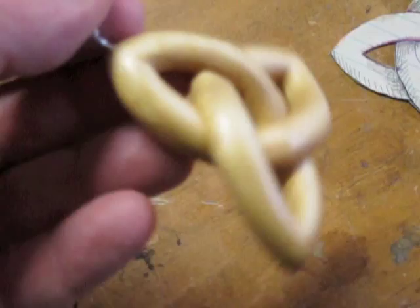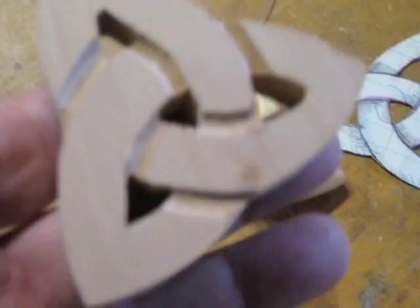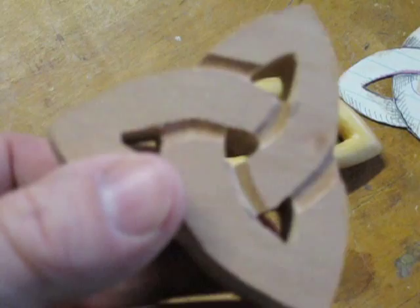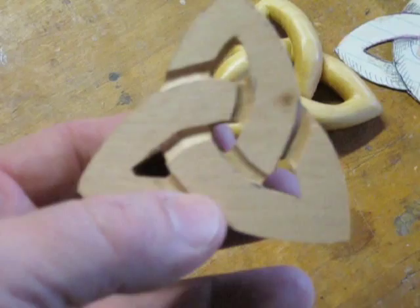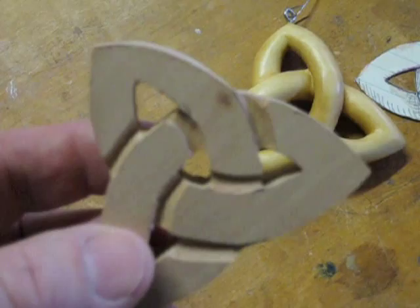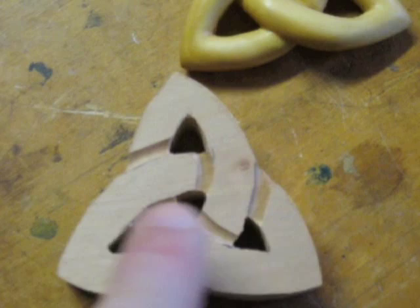Here's one that I'm going to start and show you guys on video. I've already started a little bit on this. This is a piece of Spanish cedar, which is a nice wood to carve. It's soft and it'll have a nice mellow color — almost like a light mahogany or cedar color when it's finished. It is a little prone to chipping, so you have to be careful. This project has some inherent difficulties because you have a pattern that disregards grain patterns, so it almost doesn't matter how you lay this out on your board.